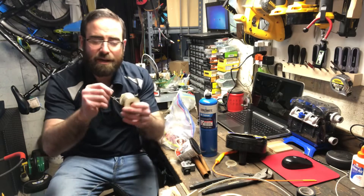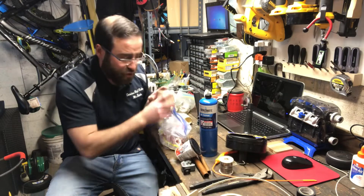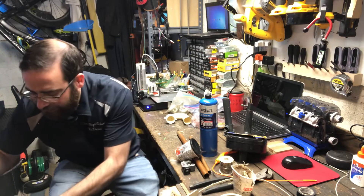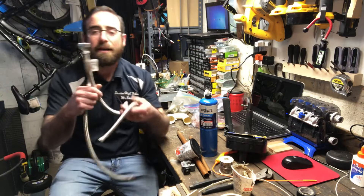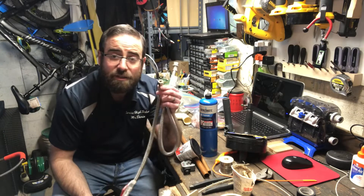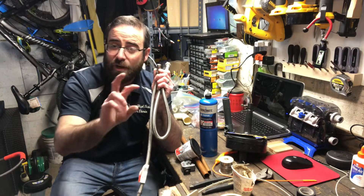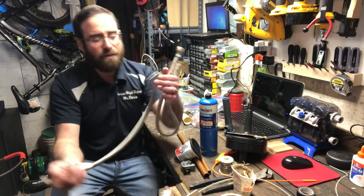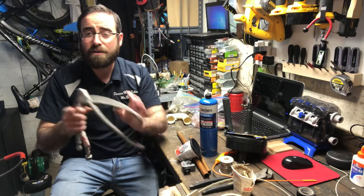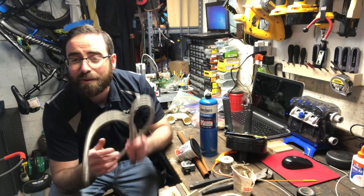I found my solder at the bottom of the bag, which I use with a torch to sweat-solder copper pipe. Those are all things a general homeowner or DIYer should have. It's also nice to have flexible supply lines — pretty standard for connecting to a sink or toilet. They're sold in various sizes and sometimes they fail or break over time, so having one or two extra is valuable — especially if you have a leak at 10 o'clock at night when stores are closed.